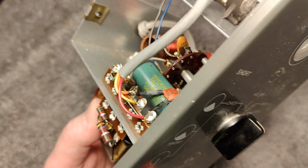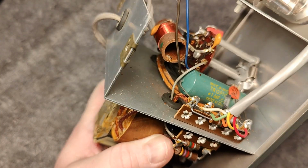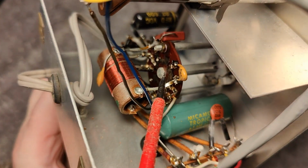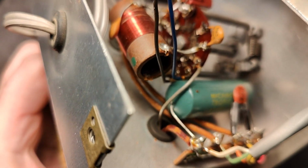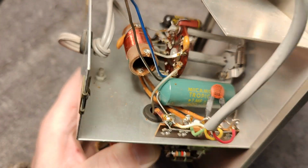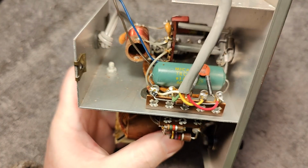Maybe I can get a little bit of light in there so you can see there is a little metal part here on this front side, and that is the mains. But the distance between the two layers, what you call the sections of this switch. Some of the metal goes through some tiny little holes in here and is bent a little bit to the sides. Let's see if I can get this thing to focus on that. I mean, it's about 1 millimeter or maybe even less. So it's not a super safe switch in today's distance safety measurements and regulations at least.